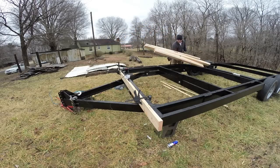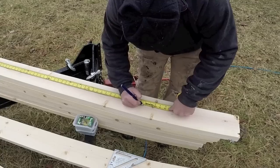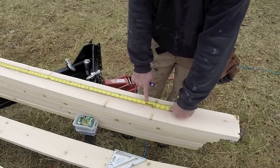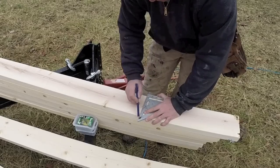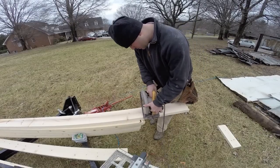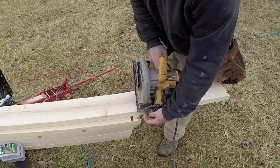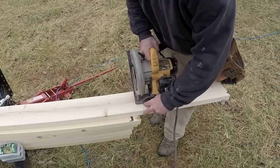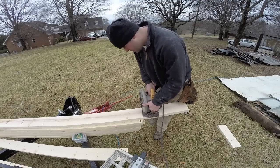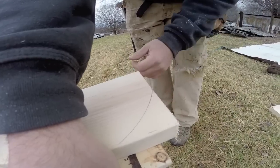The first thing I need to do is start cutting down my two by sixes. What I recommend doing is taking the board like this, marking your length, making sure that point goes right to the point on where you want it on your tape measure. Take your square, put it on that and mark it. When you're cutting you can hold the safety up, put the blade right on the mark — there's also a reference point on the front here which will line up right here, and that's how you know the blade is in line. You can see it's a pretty decent cut.